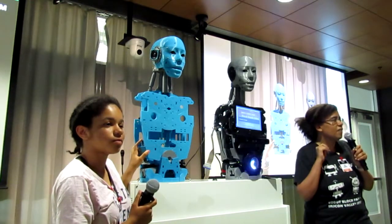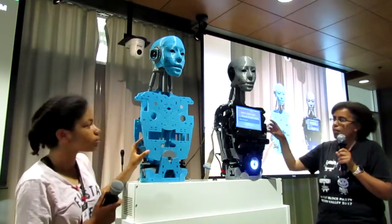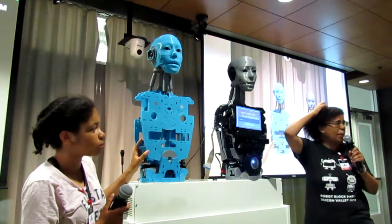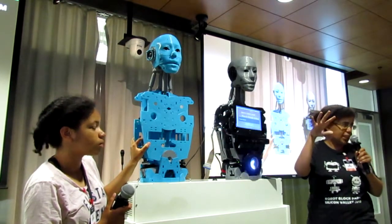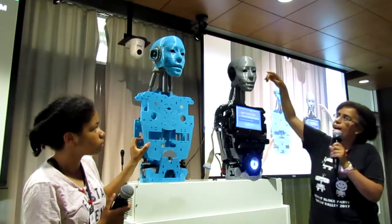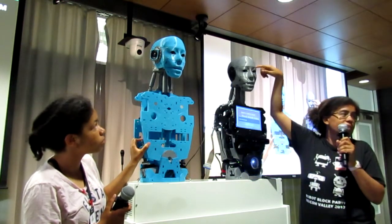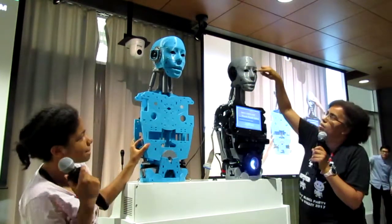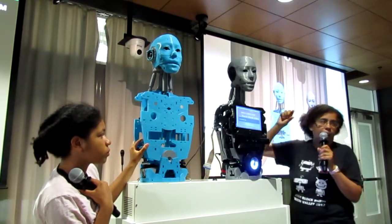Can you tell us a little bit about the hardware, the electronics, the software that you've done? Okay. So these are mostly servos. For the full humanoid, he has spec'd in there 28. I would assume most of them for the fingers, right? Because the French designer of this, Gael Langevin, has the arms as well as the torso. So you have 2 micro servos here. And by the way, one of them has a camera embedded, so you could do that too. I think both of these have cameras. So micro servos here, a standard servo for the jaw, and then everything below that is the giant servos.